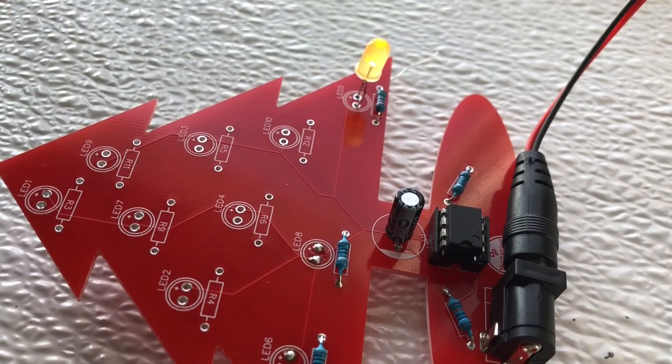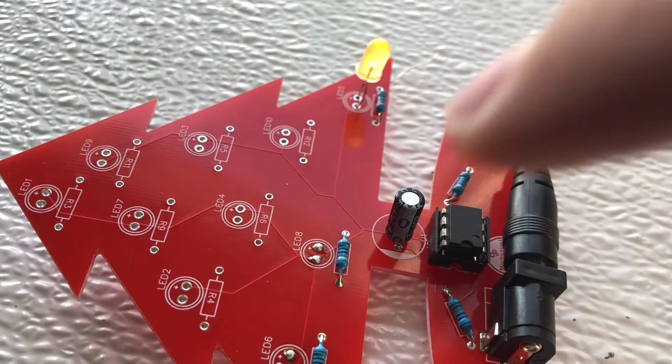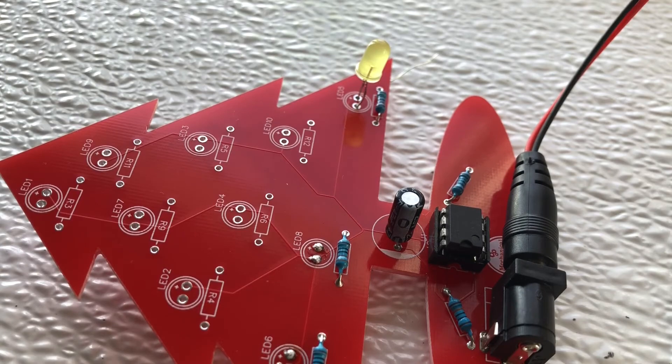I put all of the components in, like the place for the battery, the barrel jack, the IC, and the capacitor. And when I put the LEDs in, I realized they weren't turning on. So I just had to go through everything that I did, starting from the breadboard, to the TinkerCAD, to the schematic. Looking at the schematic, the only error that I made was that the LEDs were flipped. To solve the problem, I just had to turn them around and ignore the markings — on this yellow LED, the negative leg is actually where the plus sign is. So thankfully, that saved everything. Let's finish putting the LEDs in.